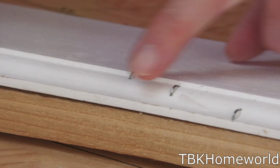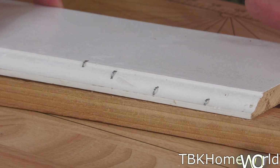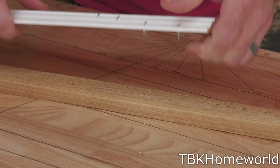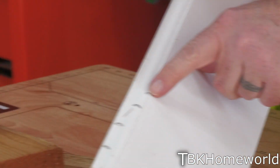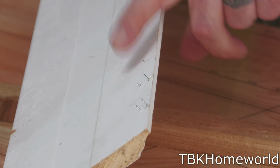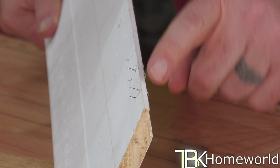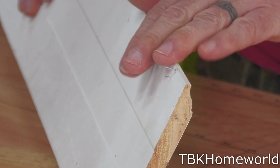Okay, so I'm trying it in different locations here, and you can see each one of these has left the crown staple up. Now let's see how deep this is, because this is the largest staples that you can put in it. Well, this top one, of course, didn't even hit anything. The one here on the arch barely got anything through, so that's not going to hold on to anything. And then of course, these staples here, that's gonna get into your sheetrock or your plaster. That won't even get down to your lath if you're doing lath and plaster.